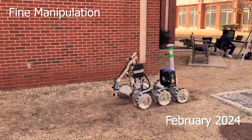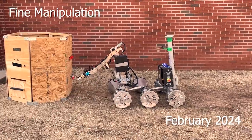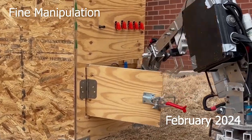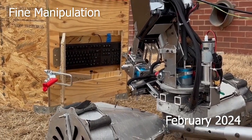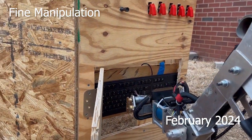A Teensy microcontroller in the e-box receives UDP packets and then writes PWM to each wheel for speed control. Each wheel also contains an independent power system to provide sufficient charge and modularity for each mission. A custom CAN bus system has also been implemented to allow reliable communication between different subsystems and sensors on the rover.